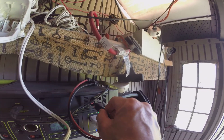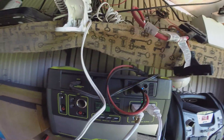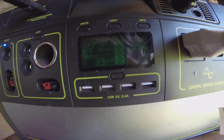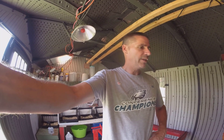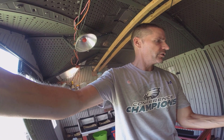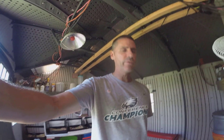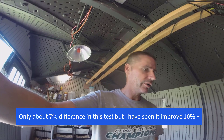Let's go back into the MPPT just to verify it. There you go — back to 210 watts. So there is a clear improvement when you're using the MPPT. Now it's not a huge difference, but there is a difference. I would say a 10 to 20% difference in efficiency using the MPPT — that's what I've noticed.